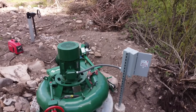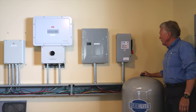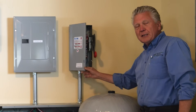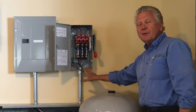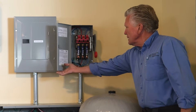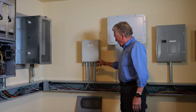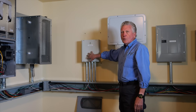The intricate complexity of how this system's electrics function has tested my own basic knowledge of power management. Let's have Ken Gardner describe how the system functions. The 6-kilowatt hydro turbine — a Francis turbine located down the river — is three-phase. Three phases come into this fused disconnect, and it comes in at about 70 hertz, ranging from 70 down to about 50 hertz. It's unregulated. From this disconnect, it travels over to the Jim Long Rectifier Dump Load Controller, rated at 10 kilowatts, where AC power is rectified to DC power at approximately 240 volts DC.